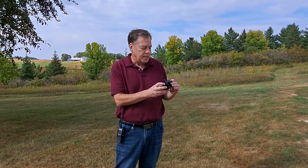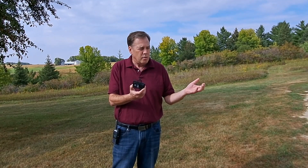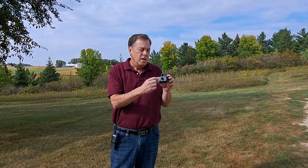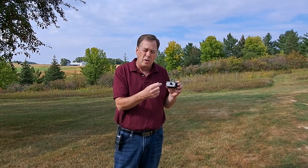This is a mixing attenuator by KC9ON, and it mixes the receive signal with a four megahertz offset and allows fine-tuning of the signal that actually ends up in your receiver, so you can control the level. As I've explained in other videos, when you get very close to the transmitter, a basic handheld on a beam is overloaded and you can't direction find anymore. Your needle's pinned, so you need a device attenuator, and this one works very well to reduce that signal strength that gets into your radio.